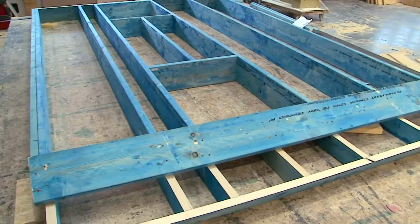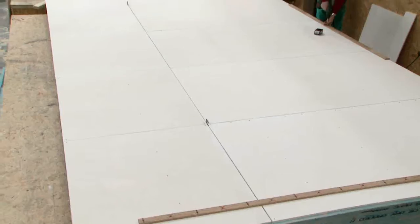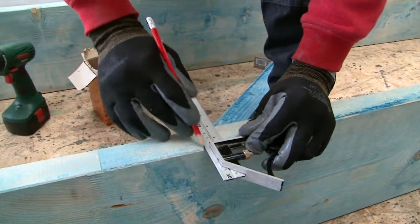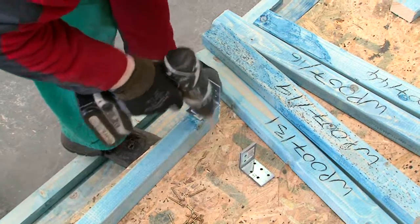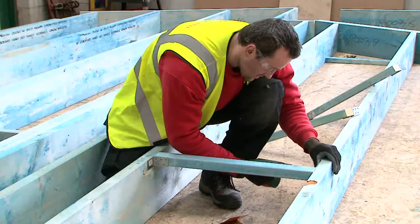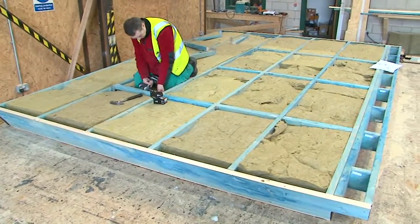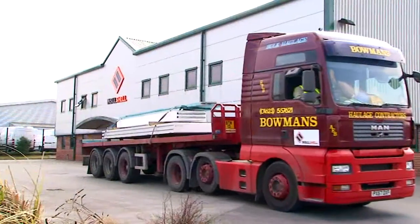It is therefore not unreasonable to consider InSolShell providing panels in excess of 20 metres in height as a closed balloon frame design. The panels are fabricated in a controlled environment to a fast-track programme to enable full recognition of the timeframe benefits of the build-off-site industry.